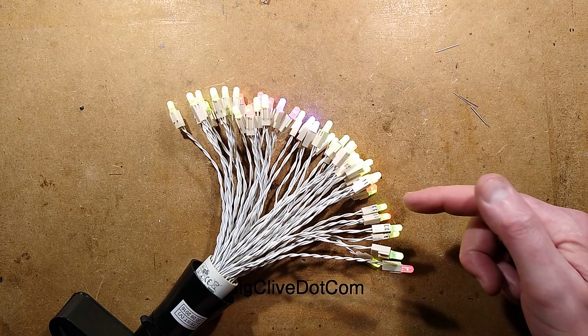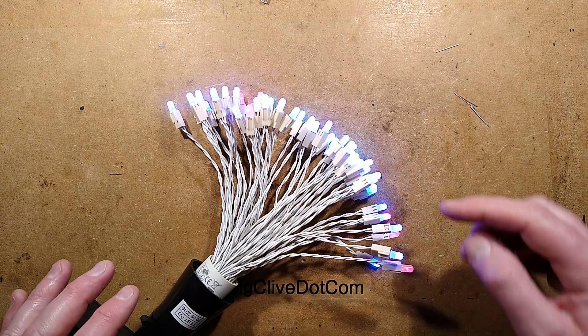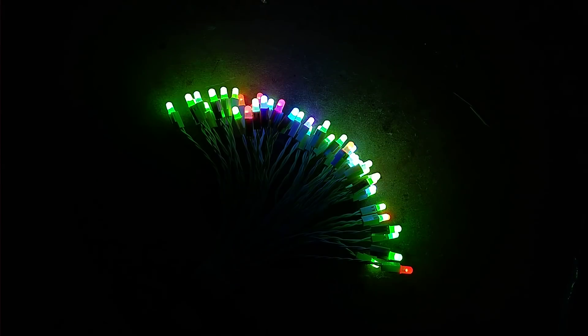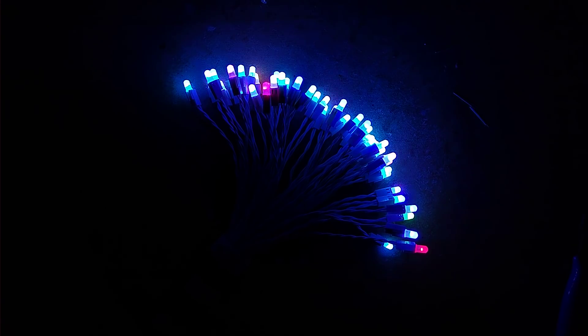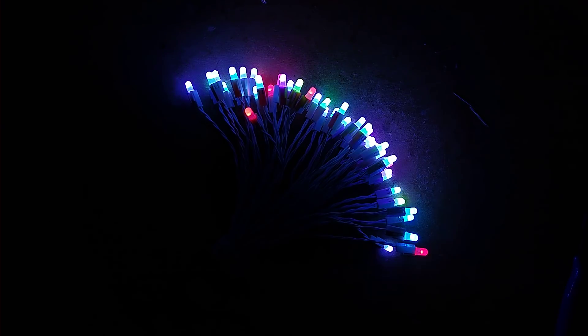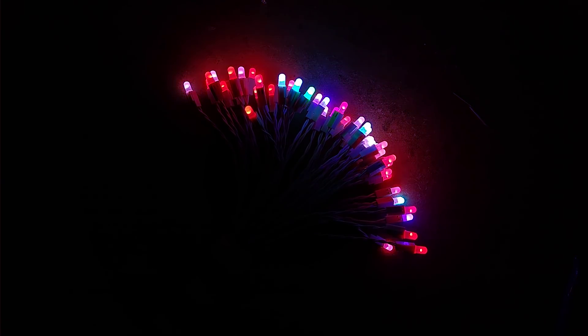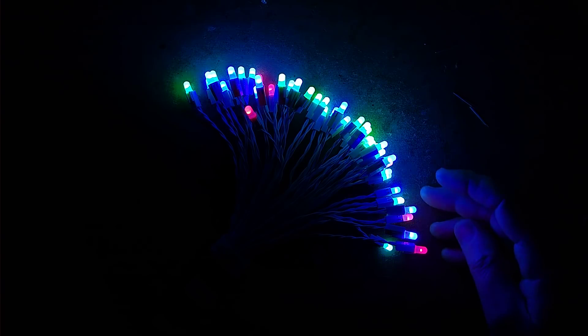They've lit up - see the flashing I was talking about. See how they're not holding the colour sequence - they suddenly jump back to red. They're not changing smoothly. And this one here is also flickering. But watch what happens when I turn the light off - they all suddenly go stable because there's nothing to disrupt them. If I leave this running now, these will all gradually go through the colour sequence but shift out of sync. Some of them are staying red - they must have some slight internal leakage, it'll be a tolerance thing. It still gives an effect and gives an interesting sparkle effect when they do jump.